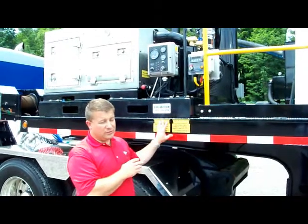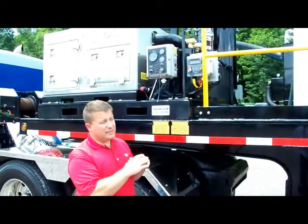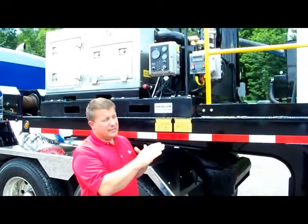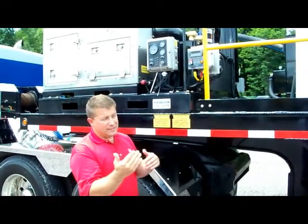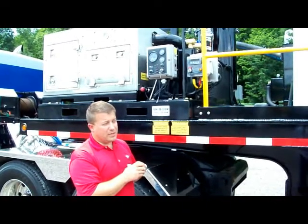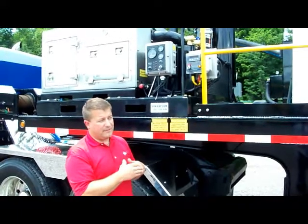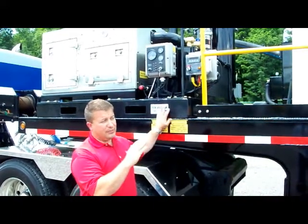But pretty well, as soon as you release the pump in neutral, the pressure starts to equalize. When you crack the gate, some material can come out sideways. That's why we have the controls not at the very rear, but up just far enough to be out of the way of any water coming out of that. Release, raise the gate completely.